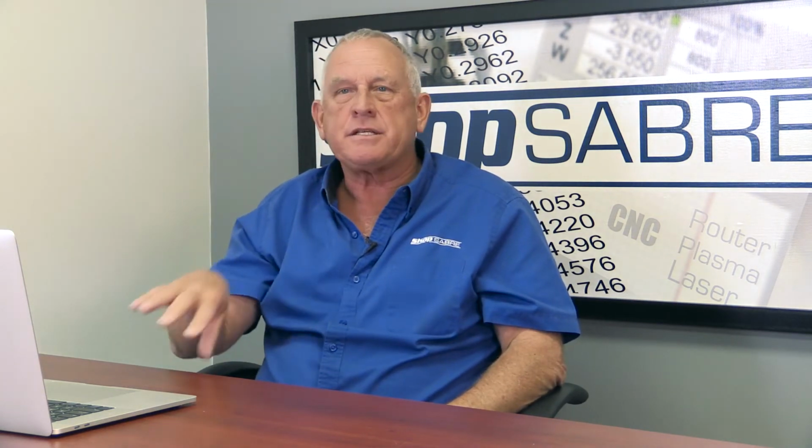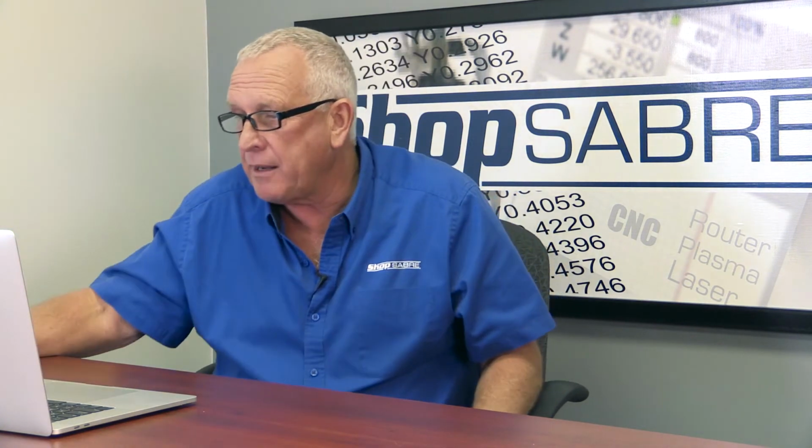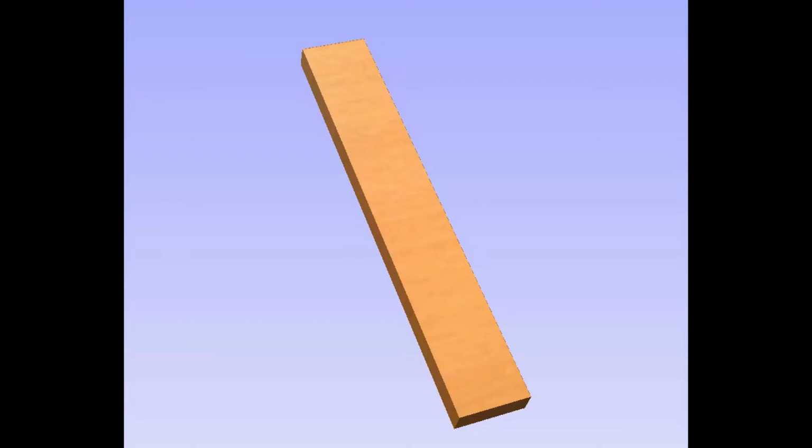Now, the next step is to flip that over. Let's take a look at that. Okay, we've got our part flipped and aligned with the pins. Now, the next step is to do the tool passes for the back. Let's look at those. First thing I'm going to do is fly cut it, and what that does is brings it down to the finished thickness of 2.5 inches. Okay, then we're going to cut our pocket in the back. Once again, that pocket is in there for electrical things. Okay, then we're going to cut the outside.